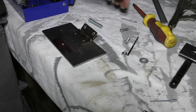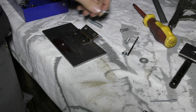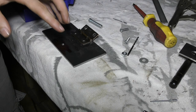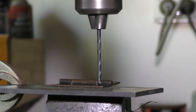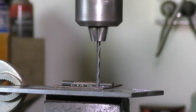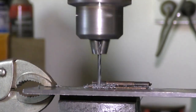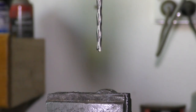So now what we're going to do is drill through with a 3mm drill bit. Something to keep in mind is that we need the base to be as flat as possible, so we're going to countersink the bottom. That way whilst it's expanding we can actually grind it down as much as we need and still have enough material underneath to hold on. The reason I'm using proper rivets is because I'm not entirely sure how hot this is going to get, and if it gets too hot it might destroy the epoxy, so we need to make sure that's as strong as possible.